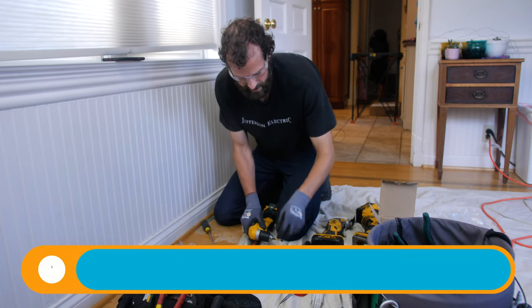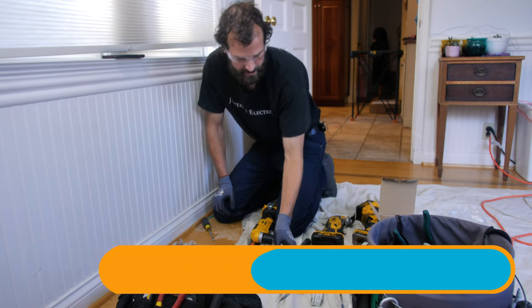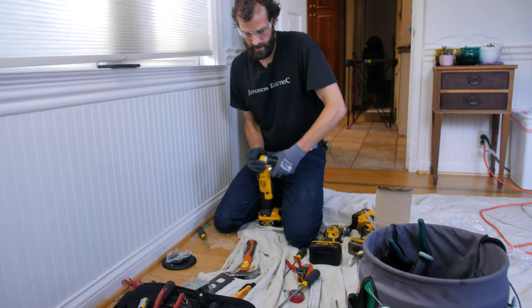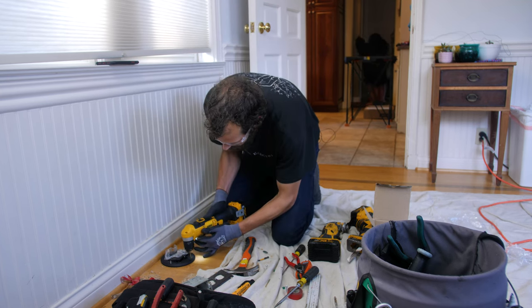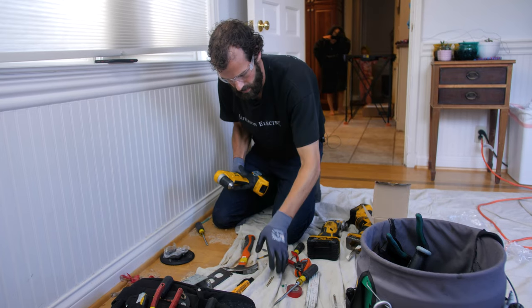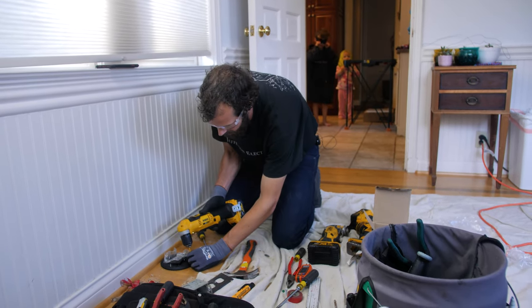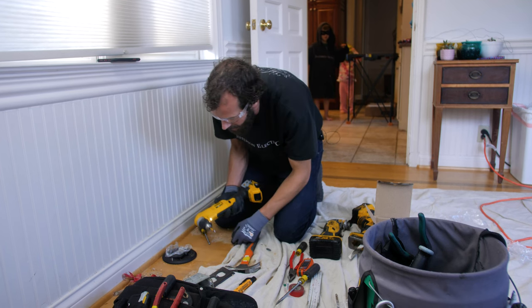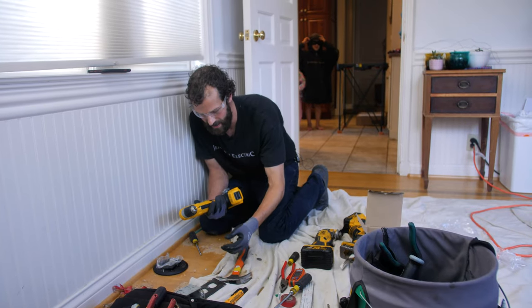So I am concerned about that one. I'm hearing some creaking and popping. So I'm going to use a slightly larger drill bit to pilot that hole because I don't want a split coming right out of the side of that. Oh, you're kidding me. Look at that. Such a cheap screw. I was barely moving it, and I snapped the head right off.